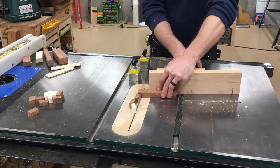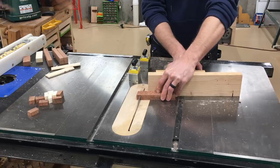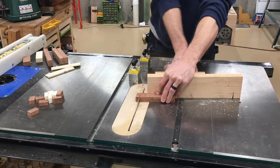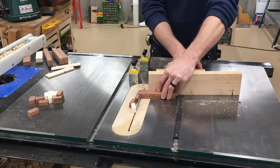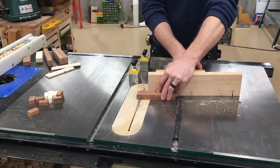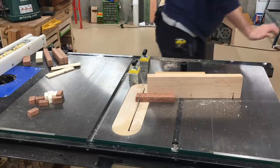One piece pushes another in such a way that the front piece rotates into the back of the blade, and then somehow the pieces jam against each other, with the end result being that a small, sharp piece of wood is fired at my head at about the same speed as the tip of the blade. I did have safety glasses on, if you're curious, but it hit me in the forehead. I'm not going to show it. No stitches were required. It'll heal without a scar.